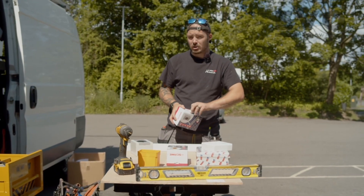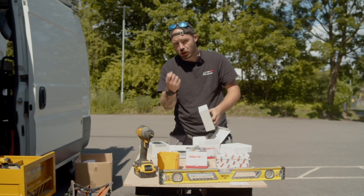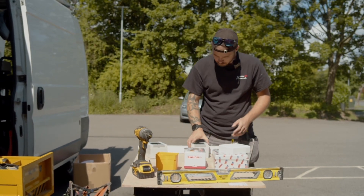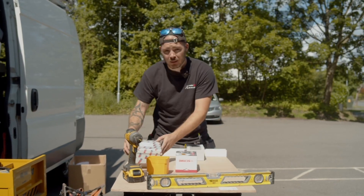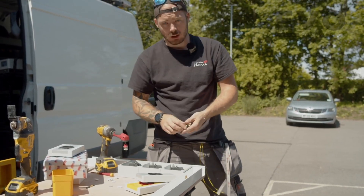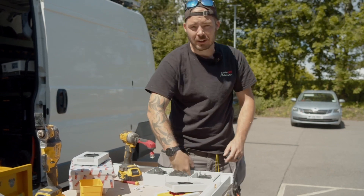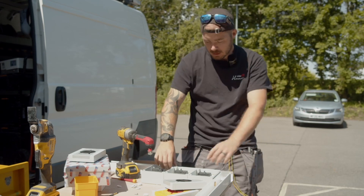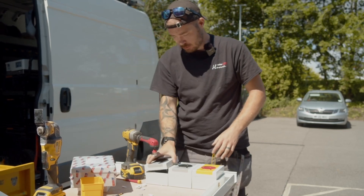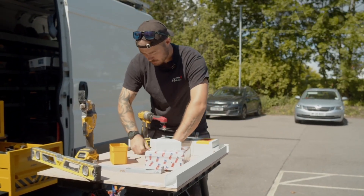That way they can just be switched off by anyone untrained or unskilled in an emergency. We'll get those labeled up, so we're not reliant upon the built-in DC isolator on the underside of the inverter — just a little bit more protection. I'm a big fan of using these bushes and lock nuts — it helps pull the trunking together and stops cables snagging and rubbing on anything uneven. We've got a few of those in for AC and DC.